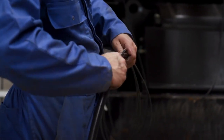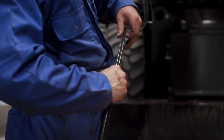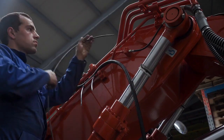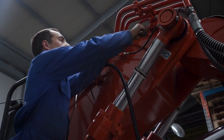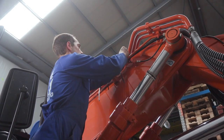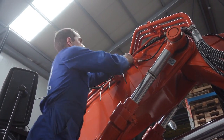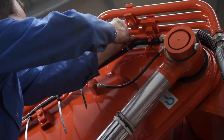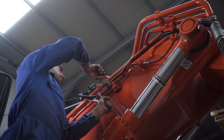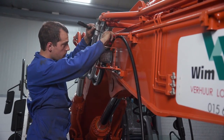Occasionally, several hoses are being routed to the same area. Larger hose guarding can be used to route multiple hoses at the same time. The installer secures these hoses using cable ties and routes them to their proper lubrication point. The common practice is to route the dispensing hoses parallel with the existing hydraulic hoses on the equipment. They are typically secured using cable ties or other mounting hardware to ensure proper installation.